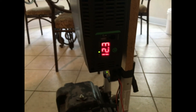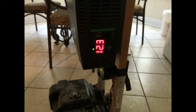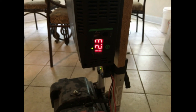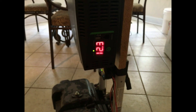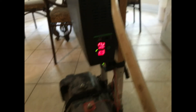I need something that will kind of deal with that startup surge. Also, this thing dragged my battery down — it started out at 12.9 volts, and just by this alone it dragged it down by about 0.6 volts under load to 12.3. That just lets me know that refrigerator is a monster and a beast. I have to take that into consideration. The testing continues.